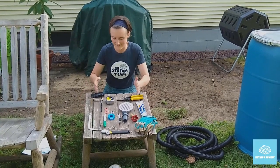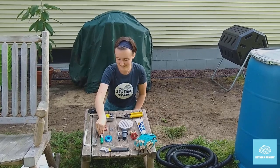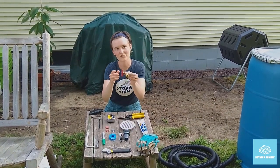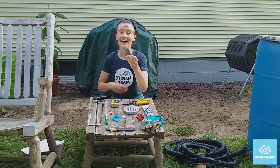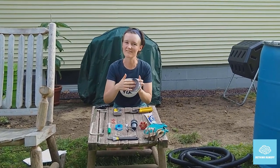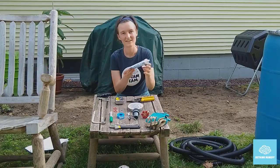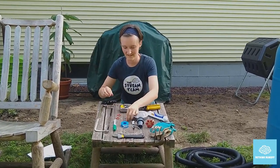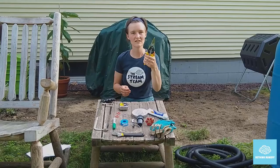So there are a few things that you'll need to build a rain barrel — we've got them all laid out here. The first thing is a hacksaw. A Sharpie for marking. Some plumber's tape to help seal and make sure that we have a tight seal on our spigot. A boiler drain spigot, usually a half inch. A half inch by quarter inch hose barb. A soffit vent louver, or just a piece of screen to prevent mosquitoes from entering the barrel and breeding. Some caulk to make sure we have a nice tight seal. A couple of hose washers. And a rigid locking nut.